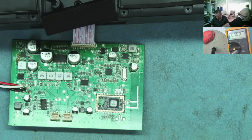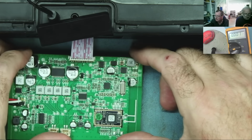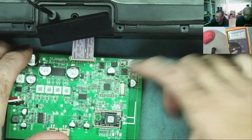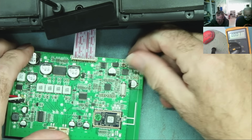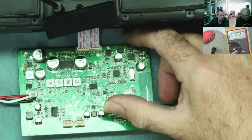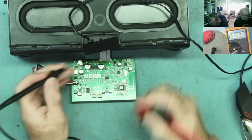It's charging. Okay. Now I want to check if the battery's still alive. Maybe there's some protection circuit in there and I didn't see this right. Not something stupid like I've lost the ground on this. No, there's something. 10.3. Okay. So what happened, the protection in the battery kicked in and it simply shut off. That's why we're seeing 2.5. Well, 2.5 is definitely wrong.